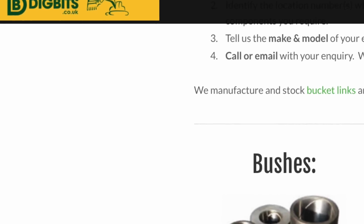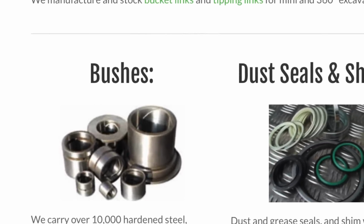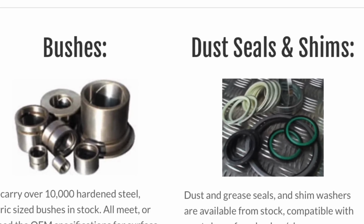That's great. But with a newer machine, as you said, with the sealed caps and stuff like that, quite often you would do so many pumps of the grease gun per day. So you don't wait to see it, because you don't want to push the cap out. But yeah, you can do it like that. You can sort of say that one has 5 pumps a day, that one has 10 pumps, and so forth. But at the end of the day, as long as you know you're getting grease in there, that's what matters most of all.